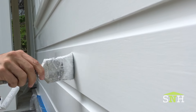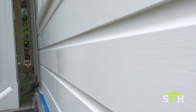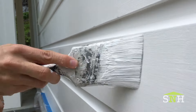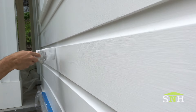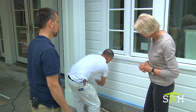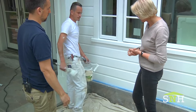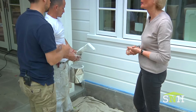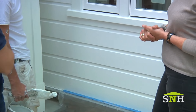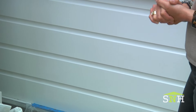Then we do two finished coats. Here we can do just one guy, but on a big ceiling like that, we need one guy rolling and two brushing. And it goes pretty fast actually doing this. Yeah, because the paint dries fast as well. Oh, so you have to really go. We have to go — we cannot waste time. Otherwise it starts drying because it's latex and then you start having those marks. So when you work like this, you save a little time and you avoid those brush marks.